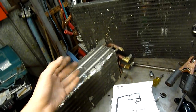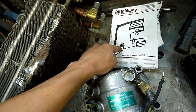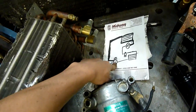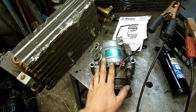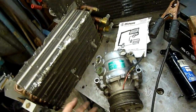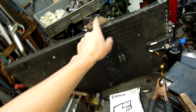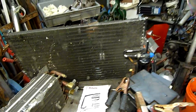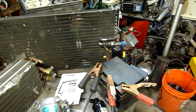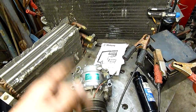So all it's doing is absorbing the heat, turning back into gas rather than liquid, and coming back to the compressor through the suction line — the big fat hose on your air conditioning system. The compressor compresses it, it takes a bit of heat from the compressor itself — they do get hot. Mechanically motorized or electric motorized compressors take heat from the electric motor as well, and it goes back out to the condenser where it exchanges heat with the air passing over the coil. All it's doing is taking heat from one place and putting it in another, repeating the cycle over and over.